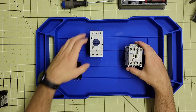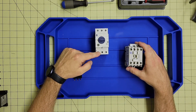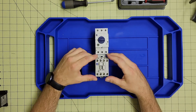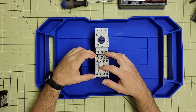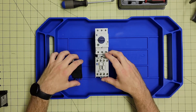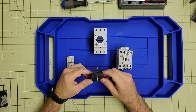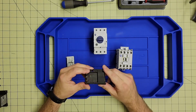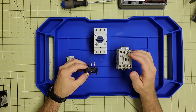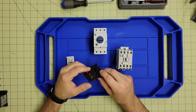To build this up, we would start with our line voltage coming in. Voltage coming out of this overload would go into our motor contactor — essentially an industrial electromagnetic switch used to turn on and off our motor. Rockwell has these ECO connecting modules which take more of the guesswork out of connecting various modules made to work together. This is the 140MP to the 100-C series.